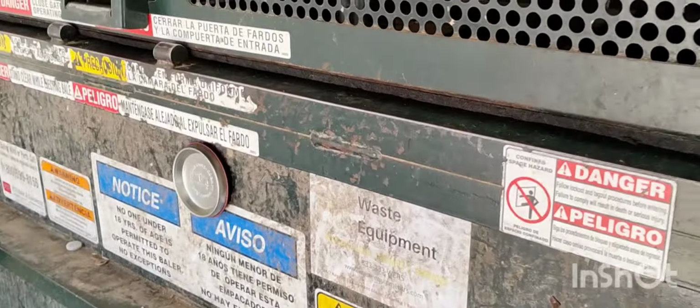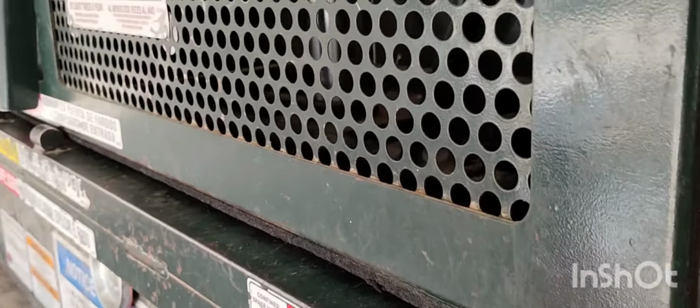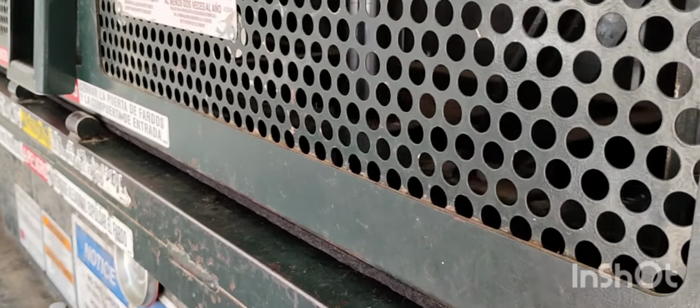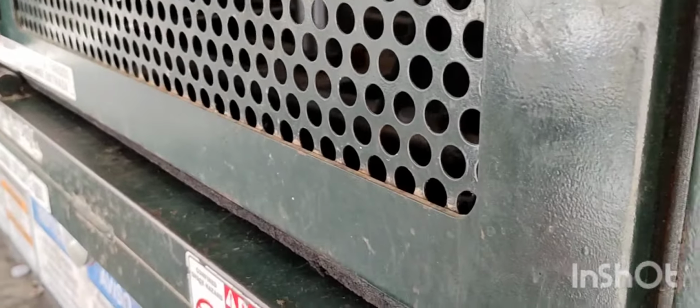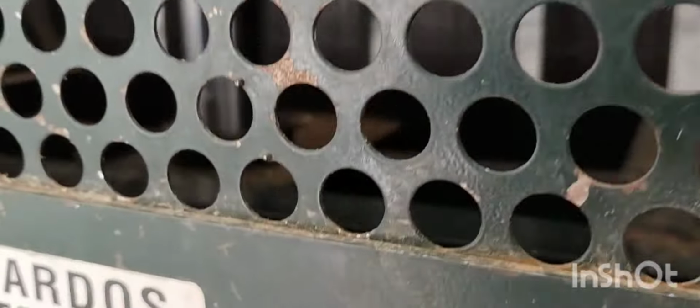The plastic will start fighting you as you get towards the top. So you want to stop the ram at the bottom and let it sit and crackle for a minute. It gets a little bit of memory in the plastic. And the temperature will play a role in this, so it behaves differently in the cold than it does in the warm weather.